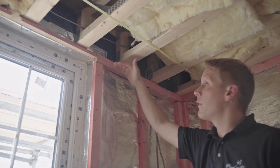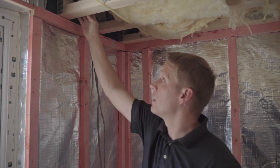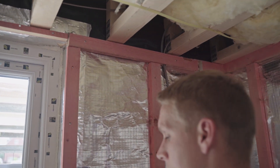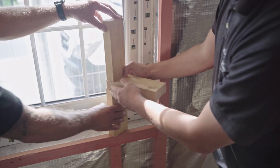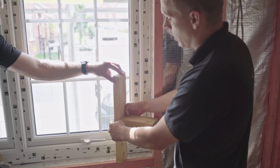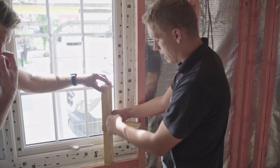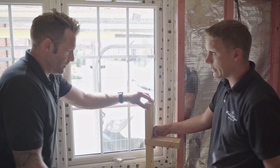When your timber frame is built, the ground floor panel is built, then your floor joists sit on top of it. Your first floor panels are then sitting on top of the floor joists. So you need a continuous air barrier running around that void. The easiest way to explain it is with a couple of blocks of wood — that's your ground floor panel, your floor then sits on top, the first floor panel sits on top of that. You need a piece of airtight barrier running around this void which links up the ground floor VCL and the first floor VCL. Lots of times timber frame companies won't install this, leaving a big void where any air that goes through radiator pipes or downlights in the ground floor comes into the ceiling void and leaks straight out the side of the ceiling.